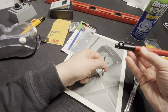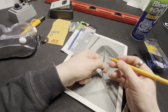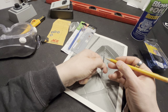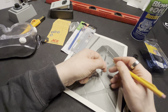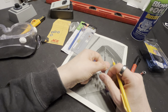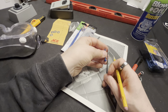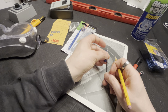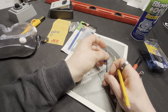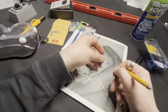I ended up using a Sharpie to mark the drill bit — not a great solution since it was a black marker on a dark drill bit, but good enough. Ideally don't use bad old tape — put your tape or depth mark slightly longer than the screw. I think one source said a quarter inch beyond, but anyway: slightly longer than the screw is how deep you want to go.